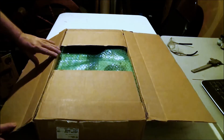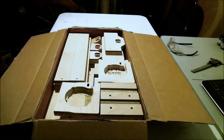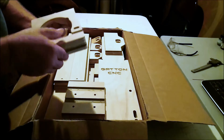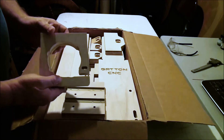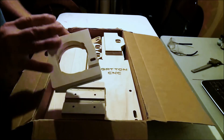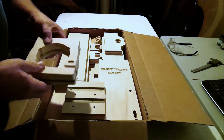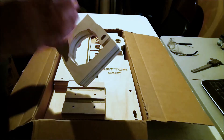When you open up the kit, you see all kinds of wooden loveliness. Here's a couple of router mounts and the router mount plate. The router mounts were designed for a router with a three-and-a-half inch base, like the Porter Cable model 690 or the 890. There are a couple of other brands with that three-and-a-half inch router motor body that will fit in here. These little cutouts are for the locating tabs on the router body.